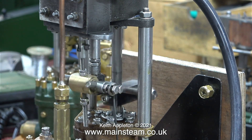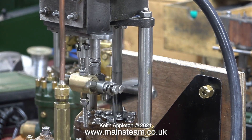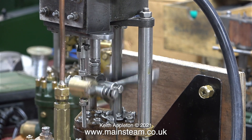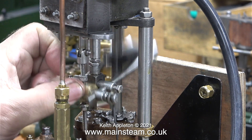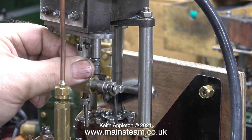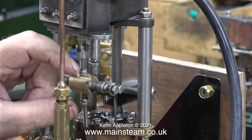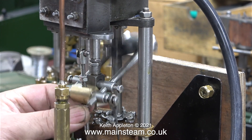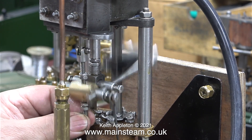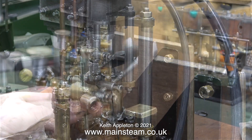The pump is running much better. No longer is it just oscillating around in the middle — it's going full length at both ends with high pressure or low pressure air. The interesting thing is, now when I adjust the lock nuts which operate the valve, it's not quite as critical. When I apply some finger pressure to either end of the valve, the pump behaves very differently. From my experience that's what's supposed to happen with these pumps, but with this pump it didn't do that until I made these modifications.